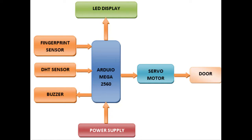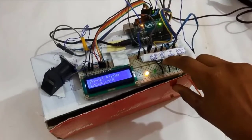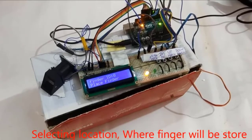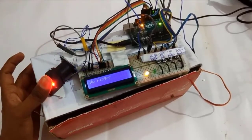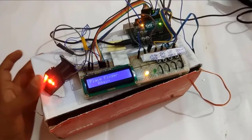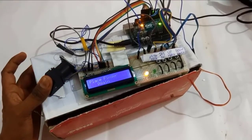The main control of our project is provided by Arduino, which senses the value from the sensor and provides the respective output signal to the servo motor. The basic idea of this project is: at the beginning, a new user should set the fingerprint image in the system. After that, when a finger is placed on the fingerprint sensor, it captures its image and compares it with all the saved images in the system.